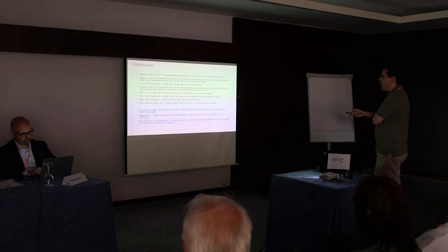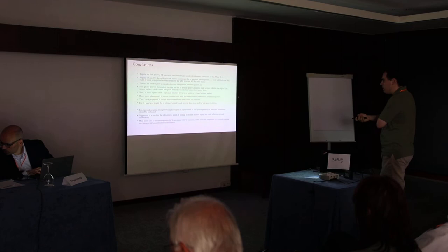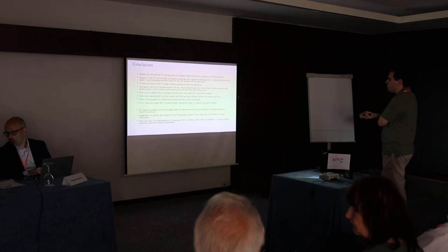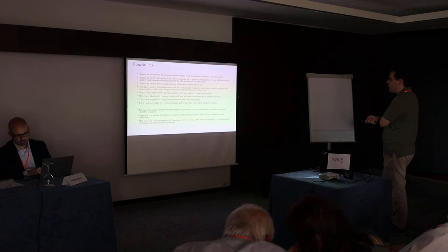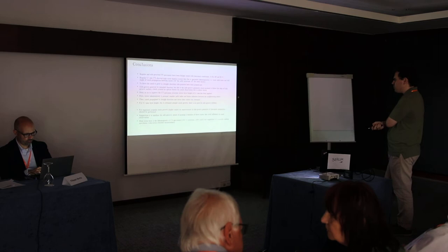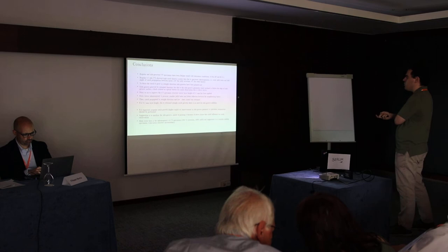And that's why the side grooves were introduced. They proved their intended function, so the crack inclined to follow a straight line, but still the crack propagated because of the geometry of the side groove. The crack started to go behind these printed layers, and that's why it was insufficient to monitor the whole crack propagation.